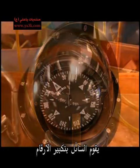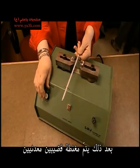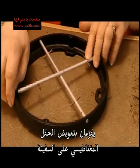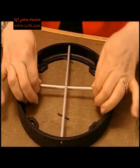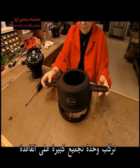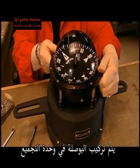The fluid magnifies the numbers. Next, two metal rods are magnetically charged and installed in the compass base. These will compensate for magnetic fields on the boat. A metal housing unit is mounted on the base, then shock absorbers are attached to cushion the compass against vibrations.